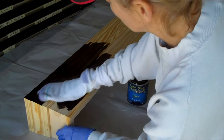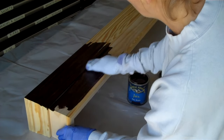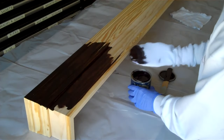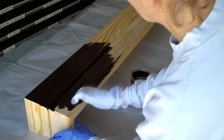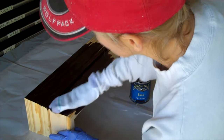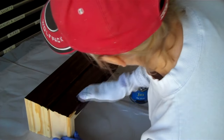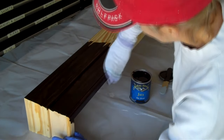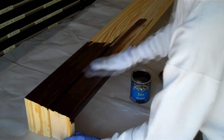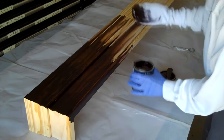Another tip is, you don't want to let it dry on you. So, if you've got a decent size area to work — and this one I do consider probably about as big as I could do with one sweep — don't rework it. Rub it, take some of the stain off, thin coat, and then try not to go back over those areas. It's very hard not to do that, but really try.